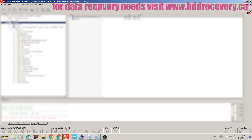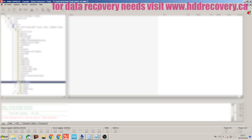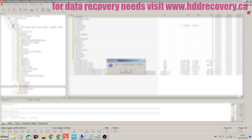Now that it's finally ready, we get to see the structure, and we can actually navigate to specific folders, map them out, and image what is most critical for the client — as opposed to imaging the whole drive from sector zero to the end. This way we know specifically where individual files are located, which is very beneficial when drives are in really rough state. Instead of forcing the drive to read content the client may not care about, we go after the specific stuff the customer needs. I'm going to map out the user profile and get everything out of there.